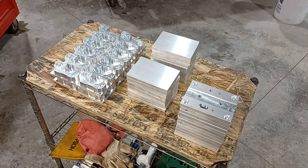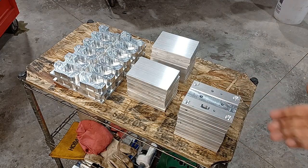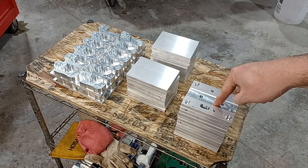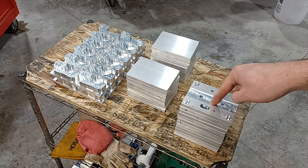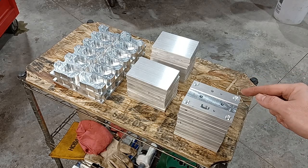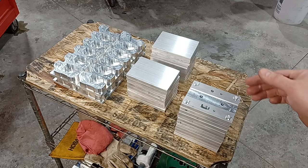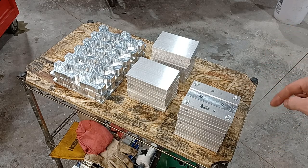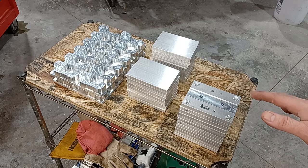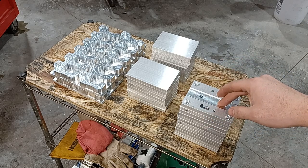If you look at all these parts — $50 a piece — and this is a 9-minute part. How quick do you think you could pay off your machine? You could probably make parts that are even more expensive. This part, when I did the prototype, it was a 22-minute program. The last time I ran it, it was 8 minutes and 56 seconds. Most of the time saved was in eliminating Z moves. The Z axis maxes out at 40 inches a minute on the Langmuir Systems MR1, and most programs, if you don't really tweak and dial the settings in, have lots of extra Z moves. Z moves are a massive time suck. By eliminating a whole bunch of Z axis moves, I took this part from 22 minutes down to under 9 minutes.